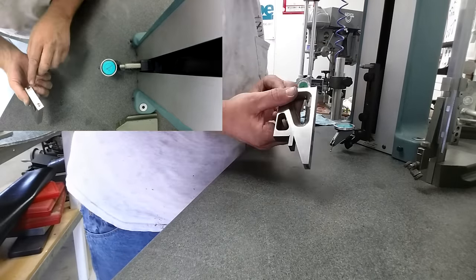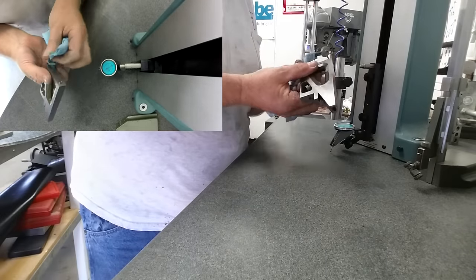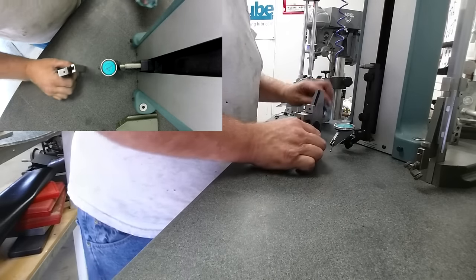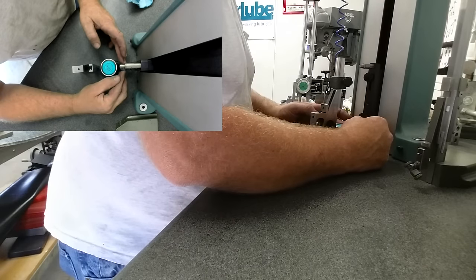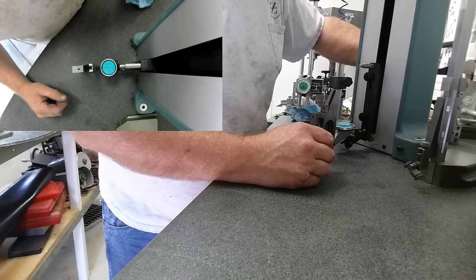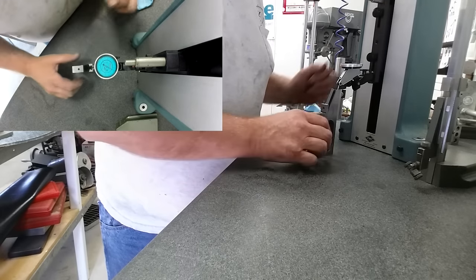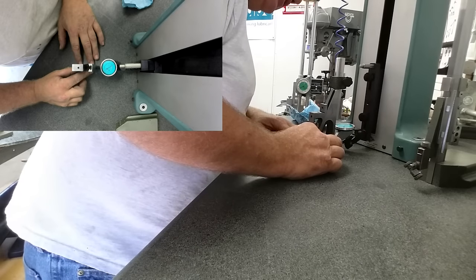We got very different numbers. There's actually some oil under it, coming out of that groove. It might have been sitting up on a little bit of oil — that would be enough to cause a bad reading. Everything matters. Let's make another sweep and see what that looks like. Okay, that's within four tenths. So we've had a three, a four, and a nine — I'm thinking that nine was the oil.